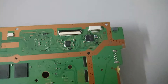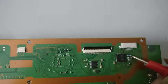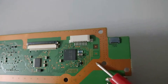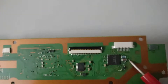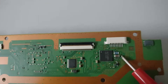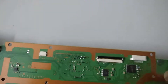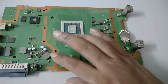This is the optical drive section. This is the motor driver IC, and you need to check this shunt resistor here — you should get a continuous beep. If you look closely, it is marked F6001. This is a fuse. You need to check continuity from one point to the other. If your multimeter beeps, you are good to go; if it does not beep, you need to replace or bypass that fuse.